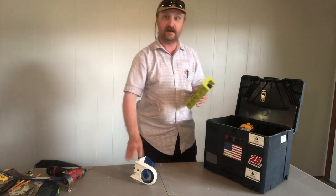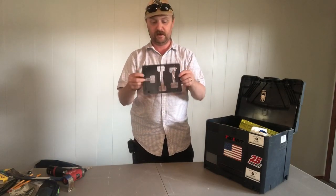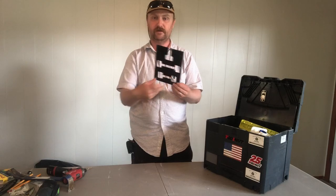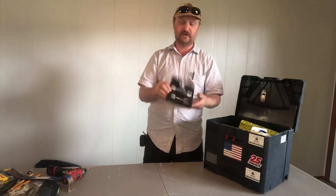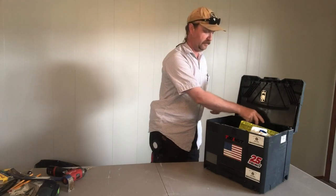This is kind of just my little setup for when you get into a house, you've got a lockout, you've got something you've got to fix. I also have a draw bolt jig in here - this is called a Flip Bolt Jig, and it's from FastCap. Your router can use it to make these little dog bone style holes, and then you can put your bolts in here to pull things together. Like Formica countertops, anywhere where you need a hidden fastener that you can just take a couple of wrenches and pull together. Your router can route these quick little dog bones out. You've got even one where you can do a single end at a time if you need to. That's been super handy to have, so it just lives in here.